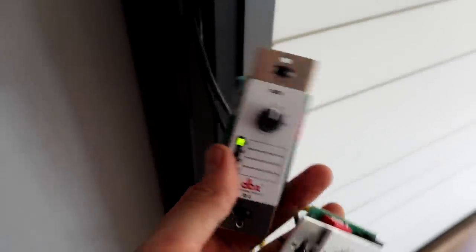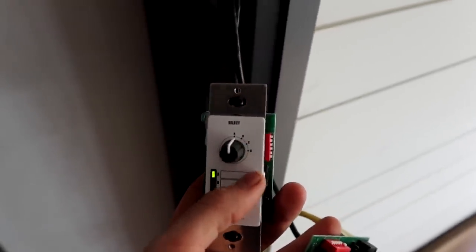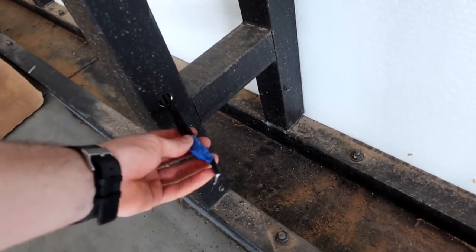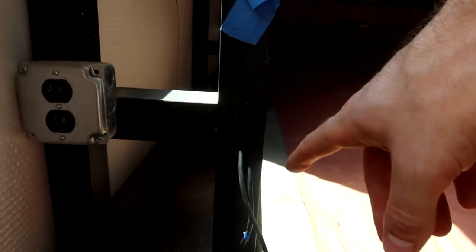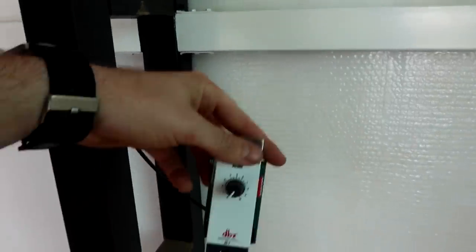Right beside the front door here, we have two controllers. These are going to be mounted into an actual box so they're clean. We have another volume control — this one's for the main room — and the master source selector. We have four different sources: the Bluetooth connector, the projector system, DJ input 1, and input 2. One of the DJ inputs is over here — two XLR cables that I'll eventually route into an XLR tap-in box. There's one here and one across the way. I also have a wire running all the way up to the speakers that go outside, and another Zone Pro controller box with volume control for the outside speakers.